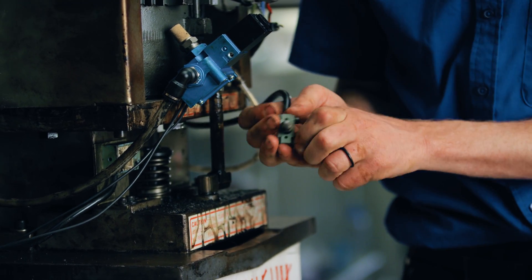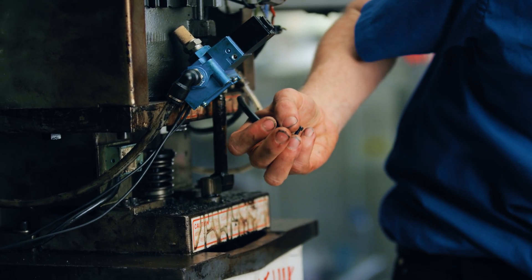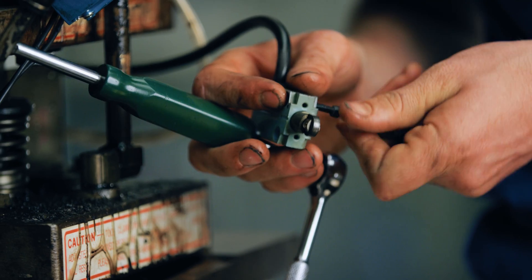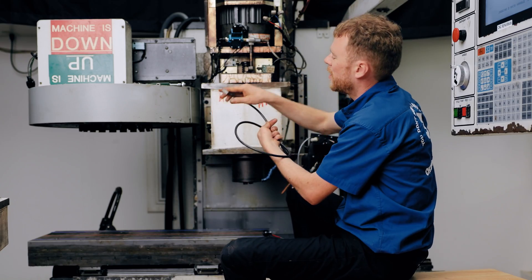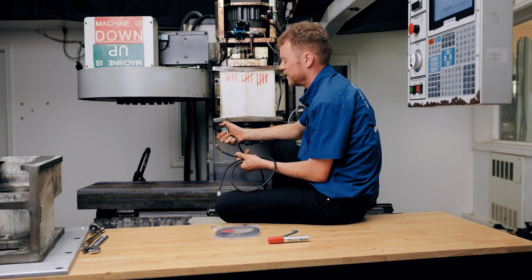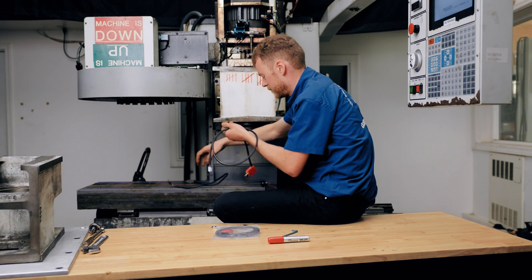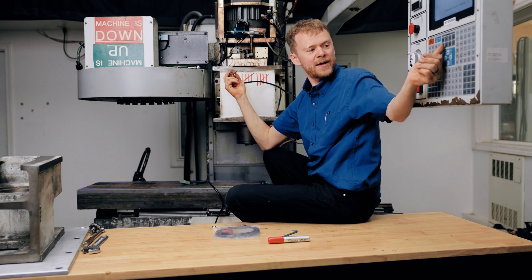There's a little bit of a flat spot here, not terribly different. I don't know if we'll have an alarm. No alarm, because this is the bottom switch. I got the old switch unscrewed and it's pretty simple — it's just a simple plug with a clip. If your switch is completely dead and it's not changing input when it's plugged in and you're pushing here, yeah, you need a new switch. We'll plug the new one in and check it — go to our diagnostics page.